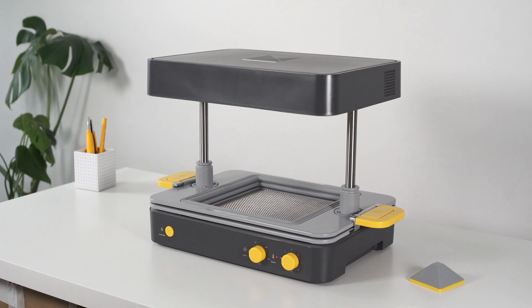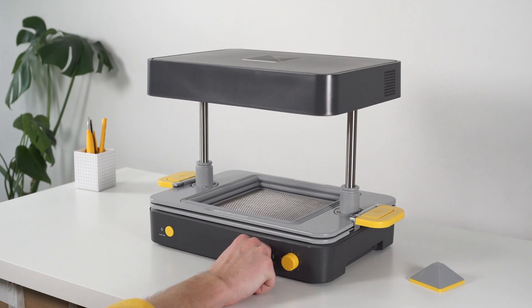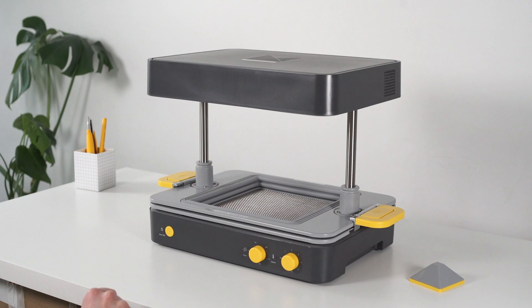Your form box is now ready to use. This is the temperature dial — turn it to switch the heater on and up to the temperature setting that you require. In this case we're going to turn it up to setting 5. This is the timer dial; it helps you to know how long to heat your material for. In this example we're going to set it for 1 minute 20 seconds. You can always find the time and temperature setting for sheet material on the instructions.